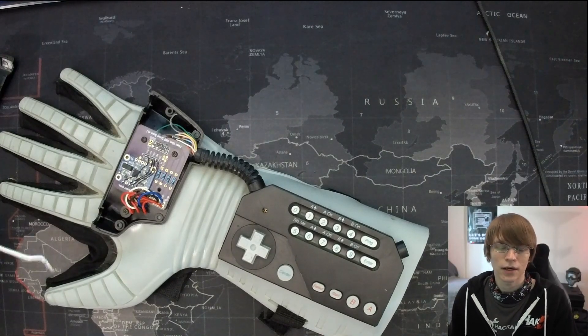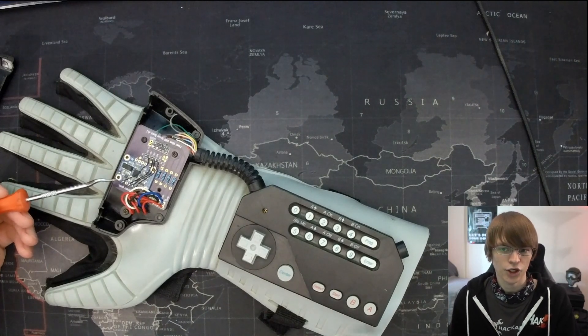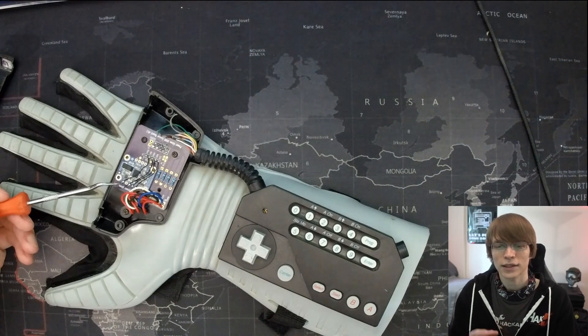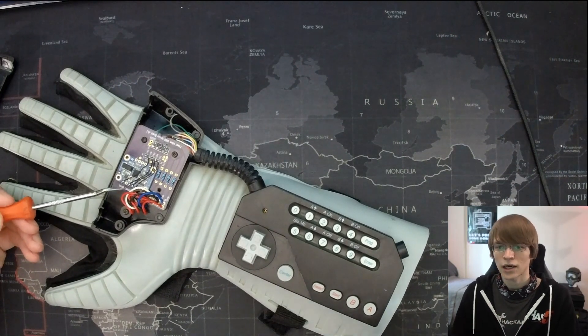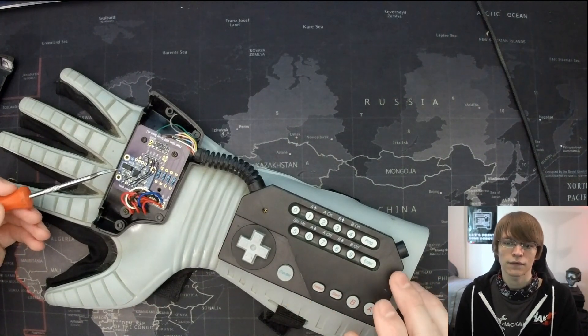Basically, I removed the original ultrasonics, made some custom PCBs, and mounted an inertial measurement unit — an IMU — to them. As the name implies, an IMU measures inertia. It uses gyros, accelerometers, and even a magnetic compass to measure its location and orientation relative to the Earth's gravity and magnetic field. That means the Earth is its point of reference rather than ultrasonic sensors mounted to your TV, so you can go anywhere and it will maintain its orientation and understand how it's moving. The military would have killed to have sensors this accurate and small back in the eighties. The great thing about the sensor I'm using — the Bosch BNO055 — is that it uses an onboard ARM Cortex chip to calculate and process all the data and give you raw acceleration and angle values for the various axes. All you do is send commands like event.orientation.x or event.orientation.y and it gives you the relevant data — no processing required. This is unlike the MPU-6000 and MPU-9000 series that a lot of drones have on board. Those are faster and send out data more quickly, but it's up to you, the end user, to process that data. I don't really have the time or knowledge to do that at the moment, so I spent about ten times more on the sensor, but it's a hundred times easier to use and integrate, where absolute maximum refresh rate isn't exactly a necessity.